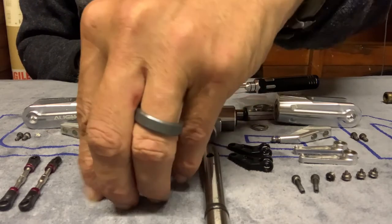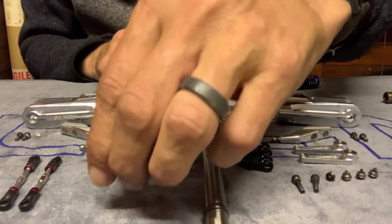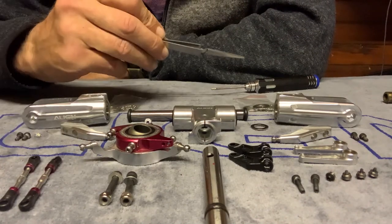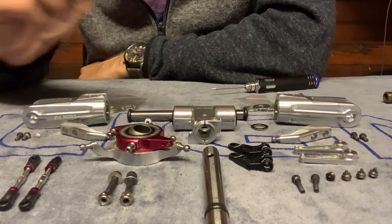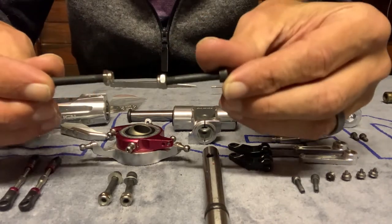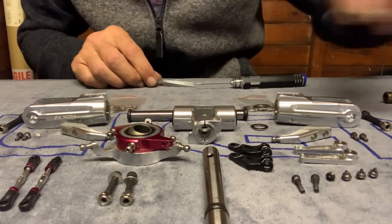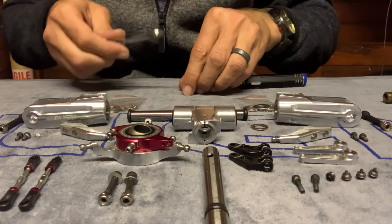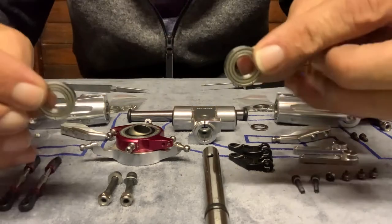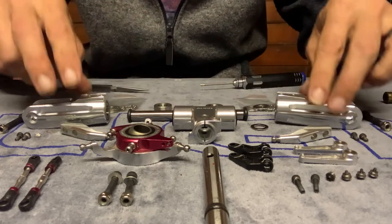The Jesus bolts, out they go, and a top tip there is always fit new Jesus bolts with new washers and new nylock nuts. Don't forget, we're not going to be using Loctite on these because they're going to nylock nuts. Some new blade grip collar bolts, enormous great big things, with new nylock nuts. In they go there. And of course, we need two new radial bearings here to be able to capture the thrust bearings in the blade grips. So they're going to go there.